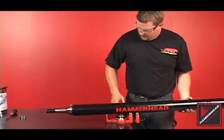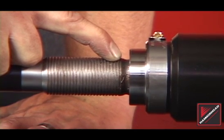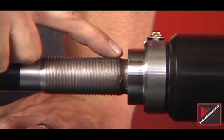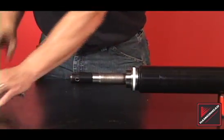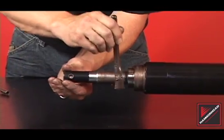Next, re-secure the tool. Before installing the head, assure that the bit shaft is in the correct position by confirming that the recessed area is pulled through, as shown. Remove the hose clamp from the head. Apply anti-seize to the head seal surface, bit shaft threads, and the mating surface of the rear head.